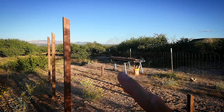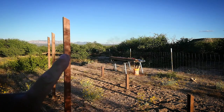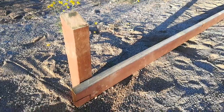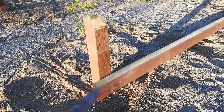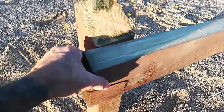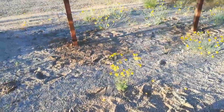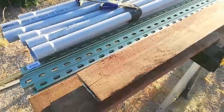I have 10 pieces — 10-foot lengths of unistrut — that will connect the front with the rear beams, and to that unistrut the panels will be attached. The post has a 30-degree angle on the top, and this two-by-six has a bevel ripped the entire length to 30 degrees as well. So when attached at the top it'll have that same bevel — an extension to the two-by-six — so the unistrut sitting on top of the bevels will sit flat and not on a corner.